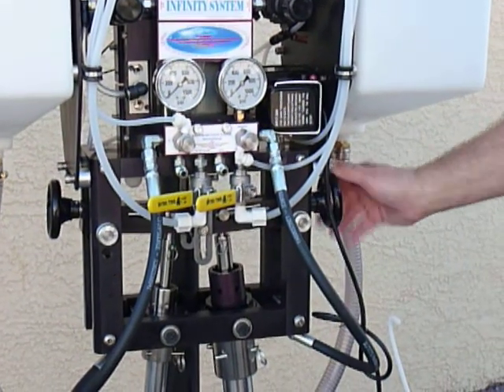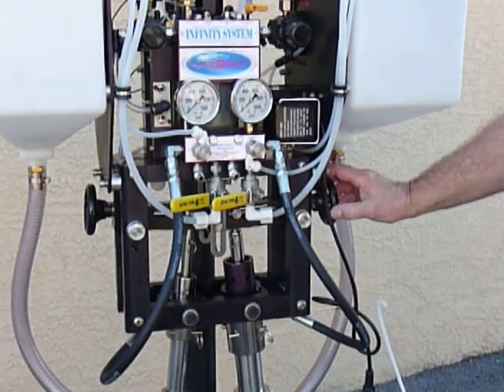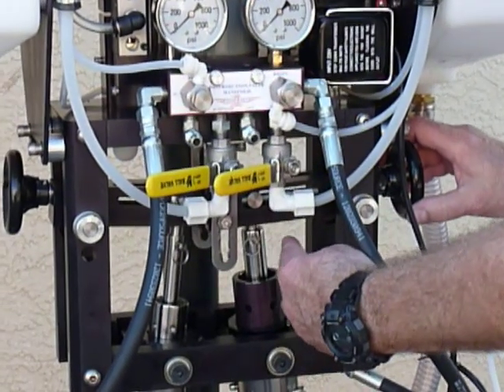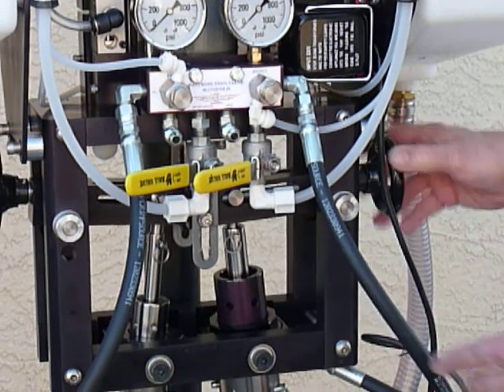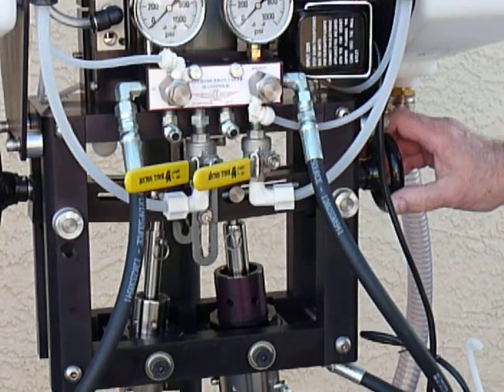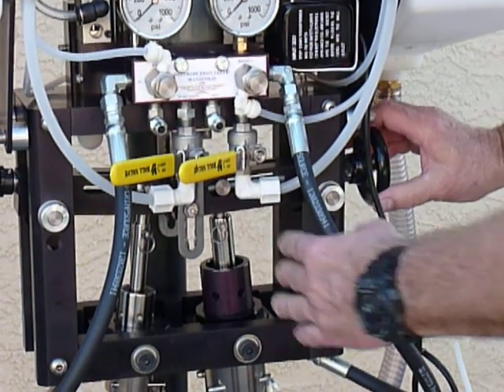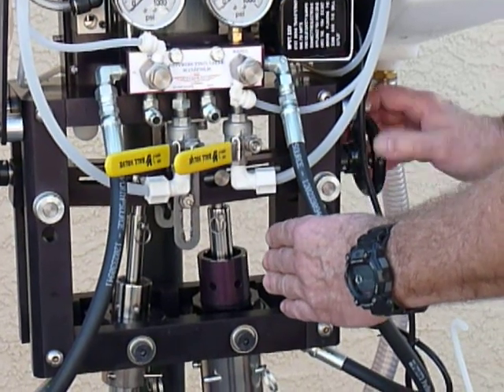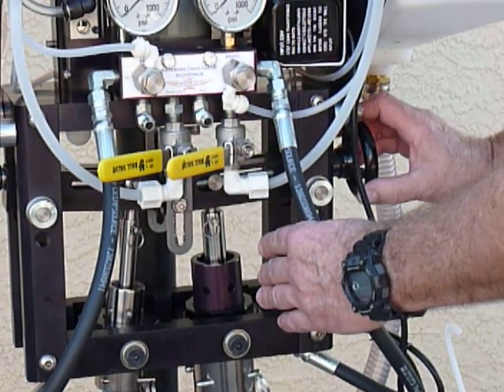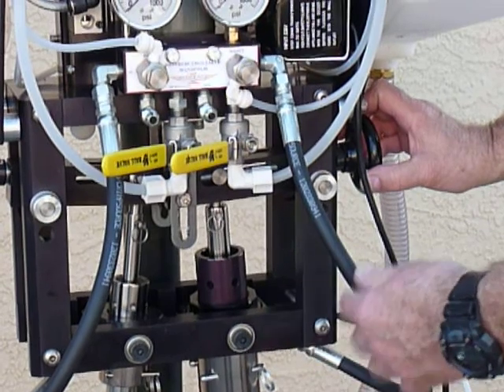So now, as I explained, as you move it away from the center line, the pump stroke will shorten and you'll get less and less output. So what you're going to want to do because of the ratio you're needing is move this resin pump a fair amount of distance, probably a quarter to a half an inch in order to get the footprint correct.